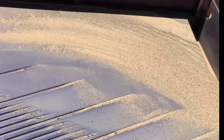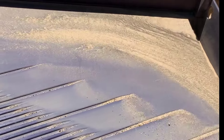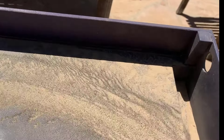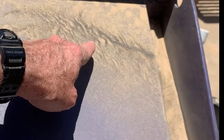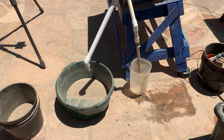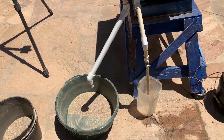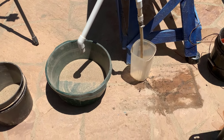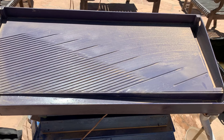Let's take a closer look at the black sand. I've got the fine black sand that I wanted, and presumably all of the fine gold would be going with it. I have a tailings bucket and a cons bucket — kind of makeshift, but it should work. Remember this table was designed for water, so it's not optimal for this, but we'll see.